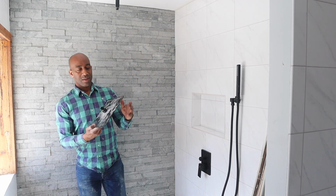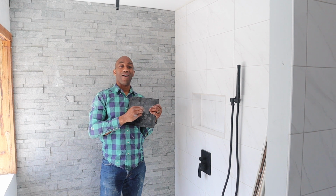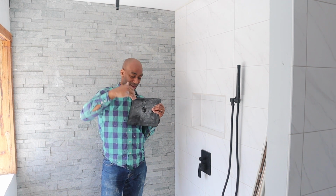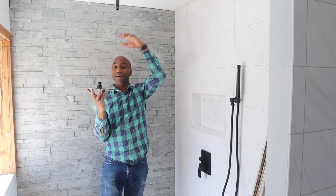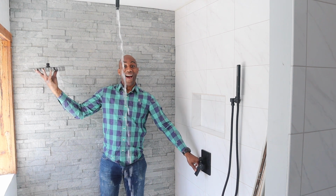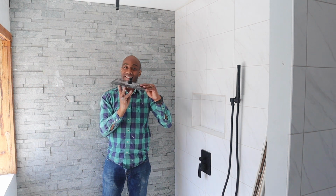We have an issue. All right, so Greg is reinstalling after that. So one mistake that we made is that we did not take this off before blowing the rest of the system out, because all the sediment came right into this aerator. So we had to clean the aerator, got it nice and clean. Now we can install it. But the proper process: take this off, open up the valve like this. Do that first, then install this, so we get that garbage out.